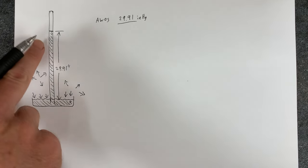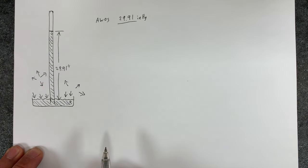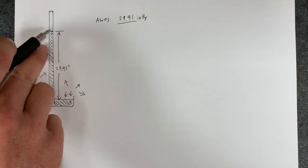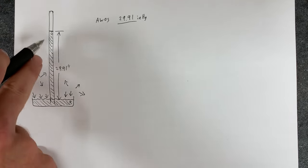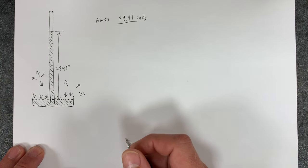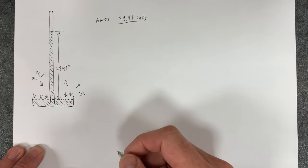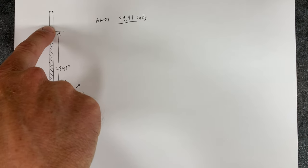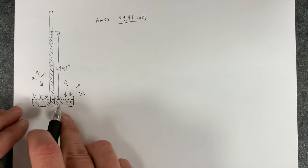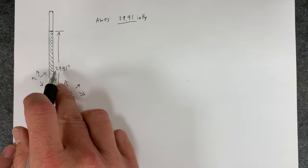You might think that just shows you how much vacuum you pulled on it. But actually, that's not right. It doesn't matter how much — it matters that you pull all the air out, and this will read exactly what atmospheric pressure is. If the pressure changes a few hours later, if it goes up to 30.03, you'll see this change also. This will rise to 30.03 because the atmospheric pressure increased, pushed harder on the fluid, and pushed the mercury up that far. That's what that number means.